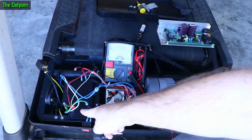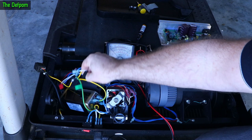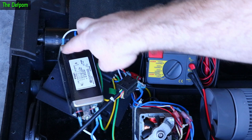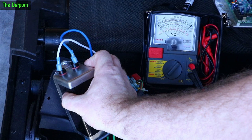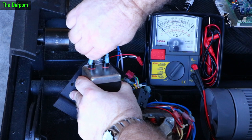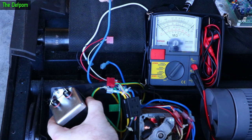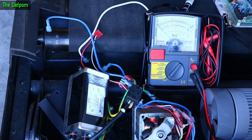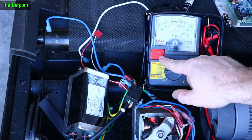What do you think is underneath this plate? I already know — there's a big input filter. Input filters contain capacitors, which is not a good sign. The AC comes straight into this filter and back out to the rest of the circuitry. If I unplug the outputs completely and retest, that will tell me whether it's this filter or something else. Testing now... still shorted. It has to be the line input filter.